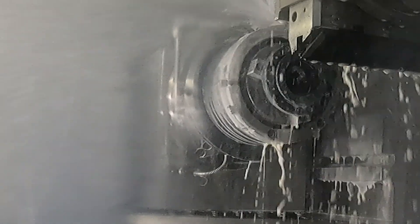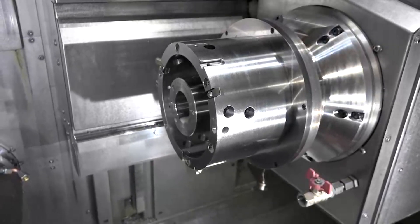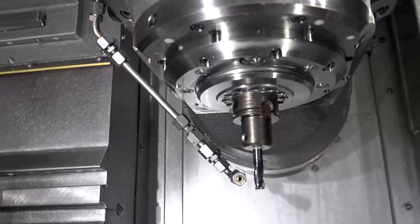Is there a max diameter size for the grinding wheel or tools that go into these machines? The diameter must be no more than 100 millimeters. A hundred millimeters — but that's really the limitation. All the components in here are lightweight, which allows it to move back and forth quite easily. It's enough from 100mm diameter to take the workpieces on the main and counter spindle. Old grinders say you must have external grinding wheels of diameter 400 or 500, then you can get the best workpieces. No — 100 millimeters is enough for our pieces.